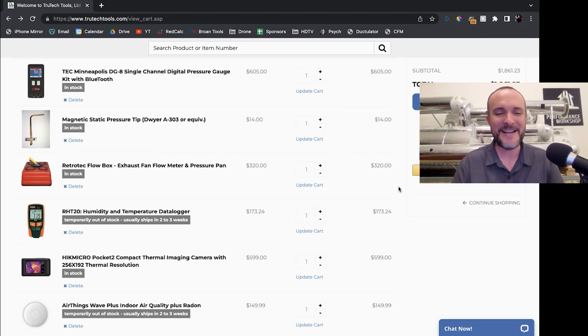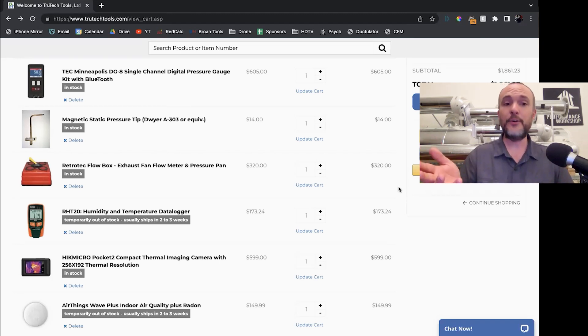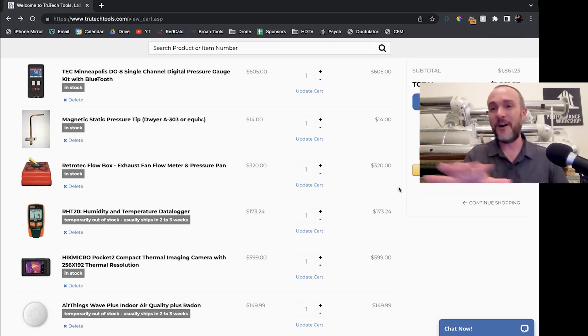When you're on the job, don't forget to take time off from all this stuff. I hope this has been interesting. Thank you to those of you who asked for this list. I had one of our Patreon members buy the DG8 and immediately find out that his master bedroom was at 30 pascals pressurization during a zonal pressure test — the most outrageous number I have ever seen. You are an army of people who can do this testing on your own homes and the homes of your neighbors and family. So let's start testing — comment, like, subscribe, tune in next time.